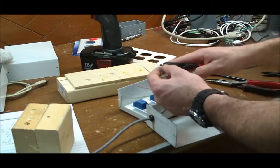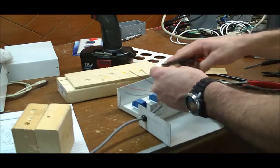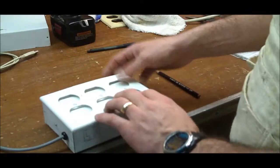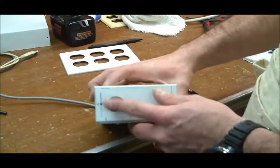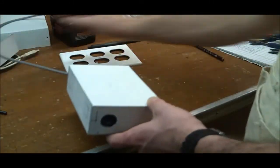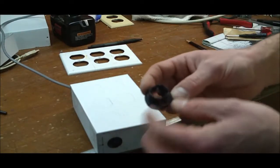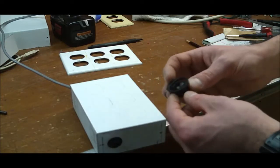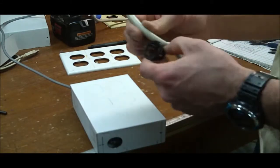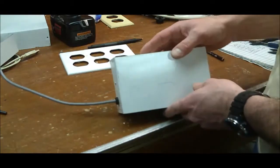I'm just going to strip these wires. I drilled a little bit larger hole for my connector to bring my mains plug in, and I'm going to use this little non-insulated grommet — you can actually get this in the hardware store for regular NM or non-metallic wiring. I'll just use that as an insulation bushing. I have it all wired up — I'll show you that in a minute.